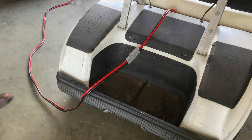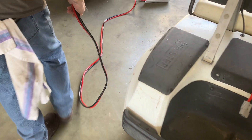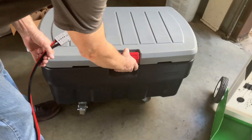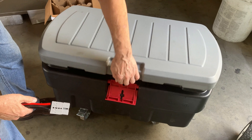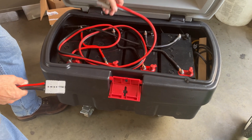If you don't have a golf car, you can use any other 48-volt battery system. The Hurricane is compatible with wet lead-acid, AGM, or lithium batteries. Here we have a 48-volt battery bank with a 5.4 kilowatt-hour capacity, set up in a tool chest with wheels added.